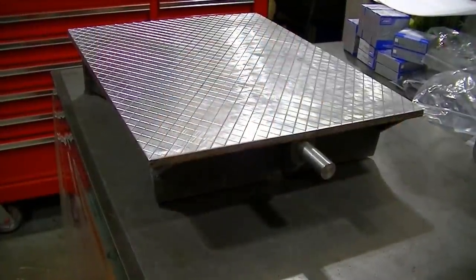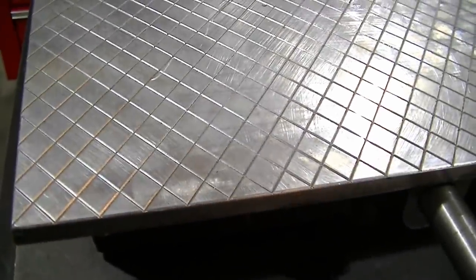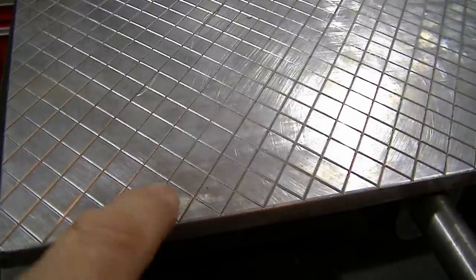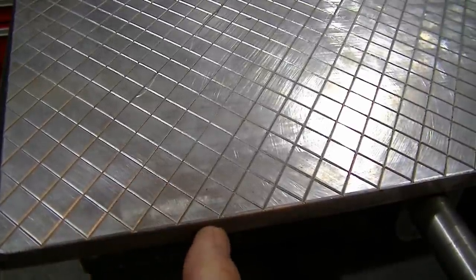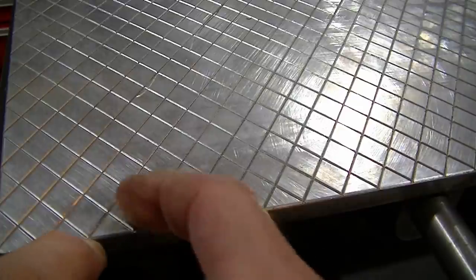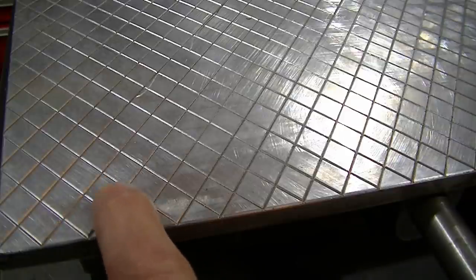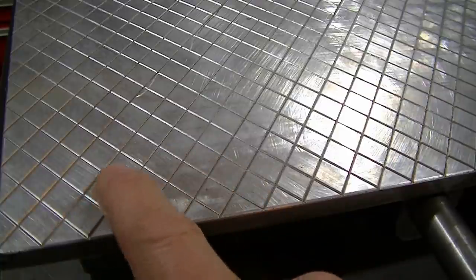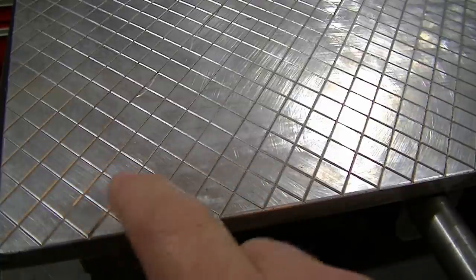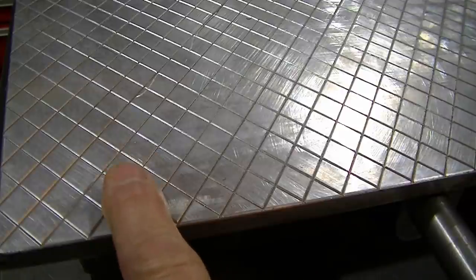There it is. That's the 50-pound plate I was using previously, but with the aluminum bonded on and grooved. One of the things that's important here is I was concerned about the bimetallic strip effect of having high expansion aluminum bonded to the iron. So my thought was, if I groove this and go clean through the aluminum, it breaks this up, and the acrylic adhesive has some ductility, or some give. That means that in theory, the shear forces that would occur at the bond line between the two different coefficients of expansion will be absorbed a lot in the glue film. All hypothetical, and who knows how that'll work.